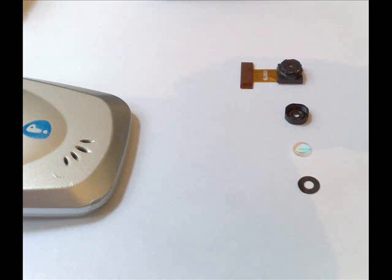You need to switch that lens for another lens without any coating. Typically, you can find other lenses if you take apart another camera or another small optical device and find a similar lens without coating. After putting it all together again, you get a camera which is sensitive to the infrared wavelengths.